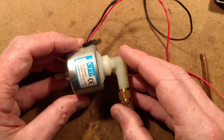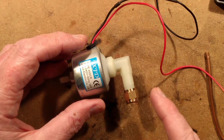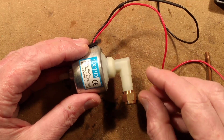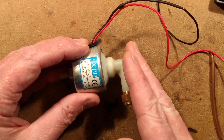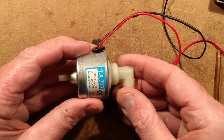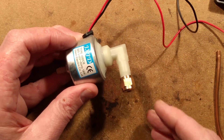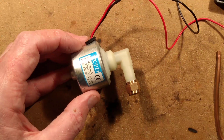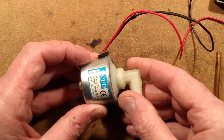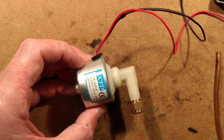The reason these pumps are used is they're very cheap, very simple, and they push through a very controlled amount of liquid. That little piston pushes a very precise portion of liquid on each half-wave of the mains, effectively making it almost like a dosing pump — though not quite as accurate as a peristaltic pump. But they're very neat and quite easy to service if you're willing to take the risk of having springs and rubber grommets ping everywhere.